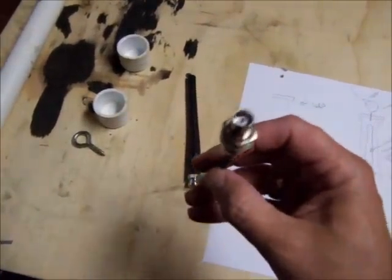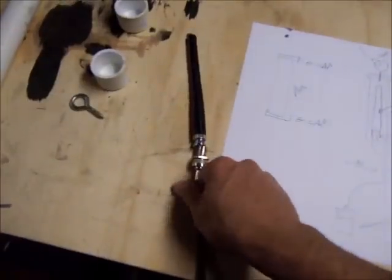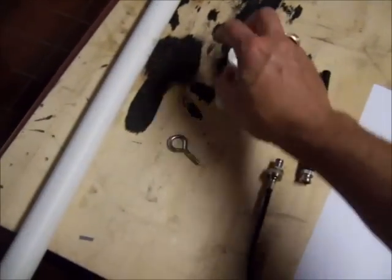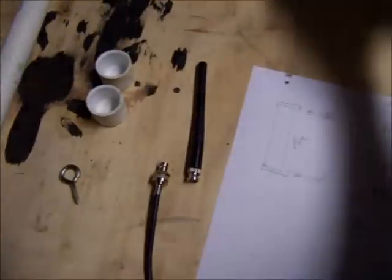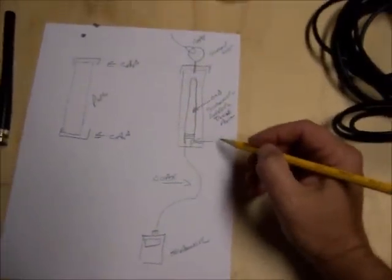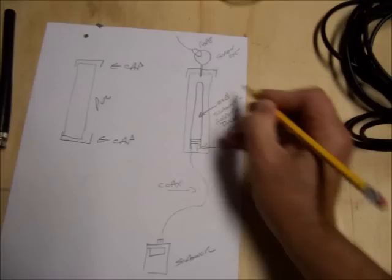This was a Hamfest pickup to connect a BNC with a mounting bracket. This is some old PVC that was laying around, and a few end caps with a screw eye. The way this is going to work — this is just to get an external antenna outside quick and easy for some emergency services scanning: police, EMS, and fire.